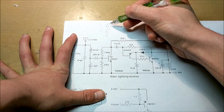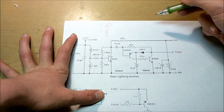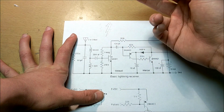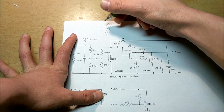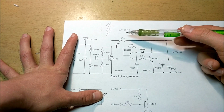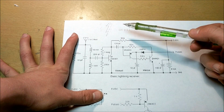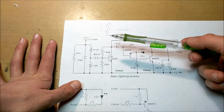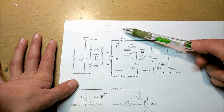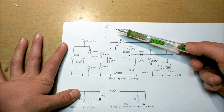Alright, so whenever lightning strikes the ground, it creates tons of different radio frequencies. It creates frequencies all across the spectrum, but most importantly, it creates a lot of stronger radio waves along the frequency of about 400 kilohertz. Now, it produces all these low-frequency electromagnetic waves as soon as it strikes the ground. Now, there are almost no other radio bands in this frequency, and so it's useful because the only time there's ever spikes on this frequency is when lightning strikes.